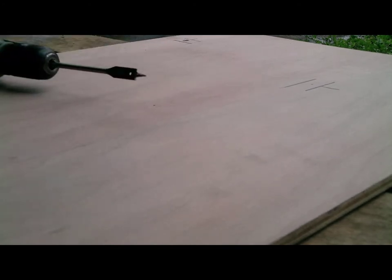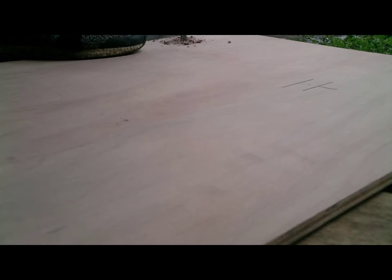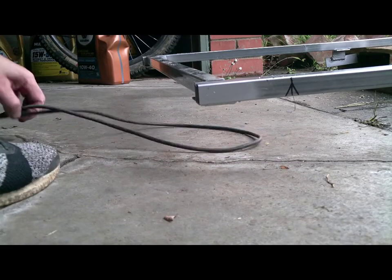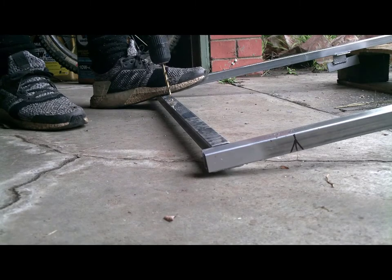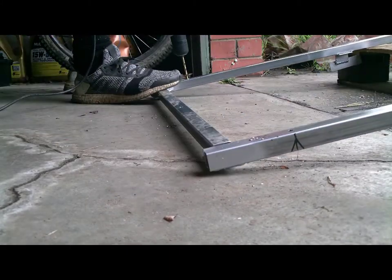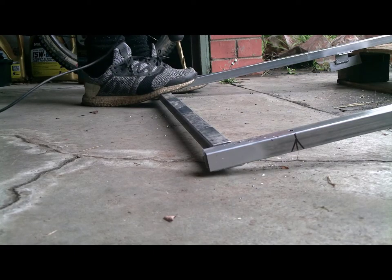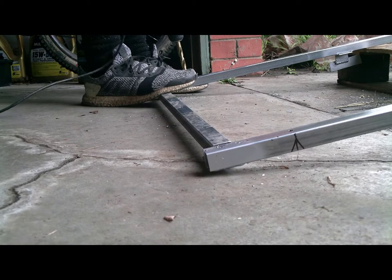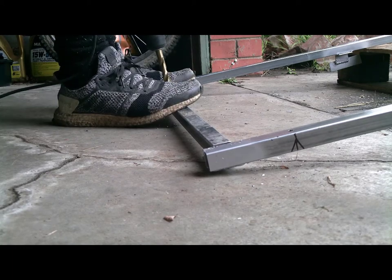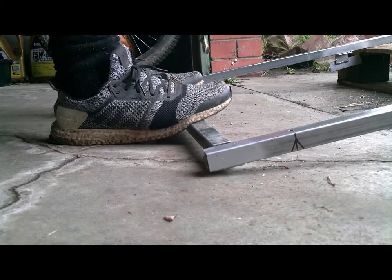So I've purchased some marine ply — this is 12mm, ideally would have been thicker, but for one person sleeping at the top it should be fine. The plywood is going to be four pieces so it can be stored inside the car while it's being driven around. When you get to the campsite it'll be assembled. Now I'm drilling the holes for the plywood to attach into — more rivet nuts will go into this and the plywood will be bolted into that steel.